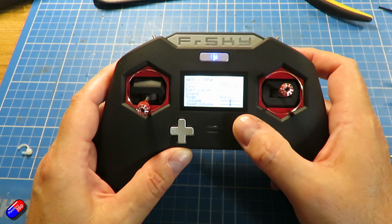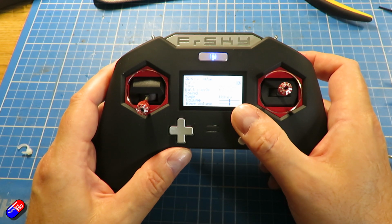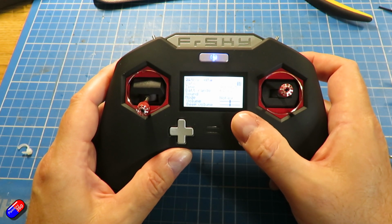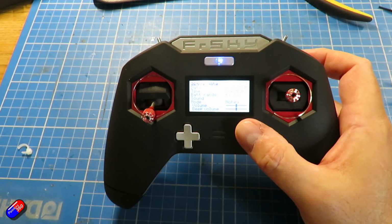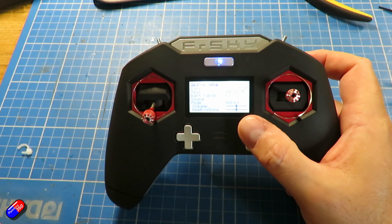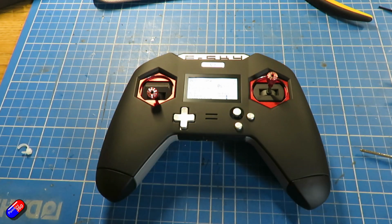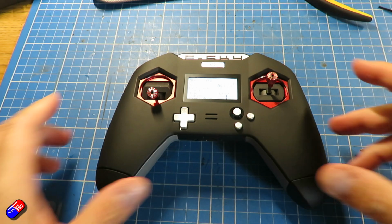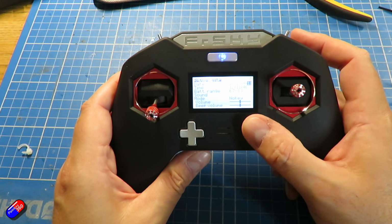That will be lost because we have had the battery out of it, and then you should be back in business. So hopefully that helps if you have an X-Lite in a similar condition. Get yourself a Duracell or similar 1220 cell battery. Again, links below to the Amazon one that I'm using here, and that's the way you can do it. As long as you've got a little Phillips screwdriver and something to crack the case apart, you will be able to do it yourself and get over that problem and have your radio starting up again without that problem.